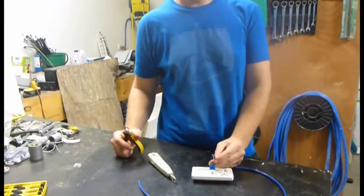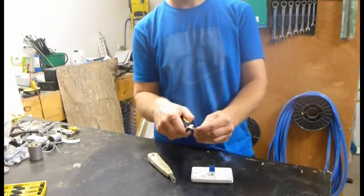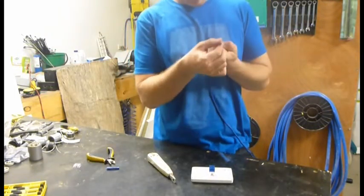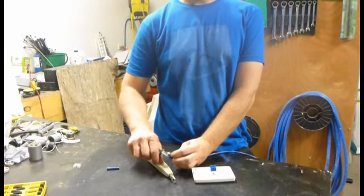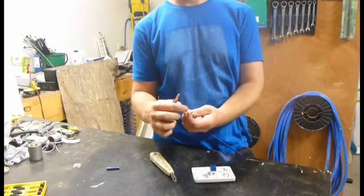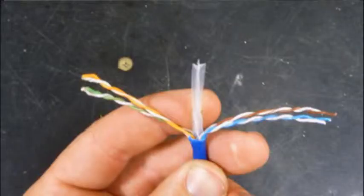So you've got a bit of cable — get your cutters, snip round it. Be careful not to cut too deep and nick your conductors, then strip it up. Just check you haven't hit any of your conductors. There's a bit of cord in there that you can use to strip the wire back if you have hit one. Get rid of that cord if you haven't. Next, there's a divider inside the cable which keeps your wires away from each other and basically helps the structure of the cable.